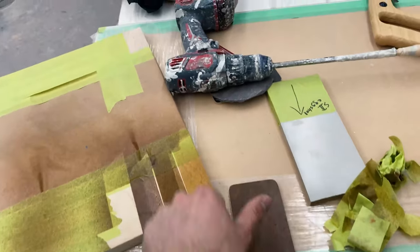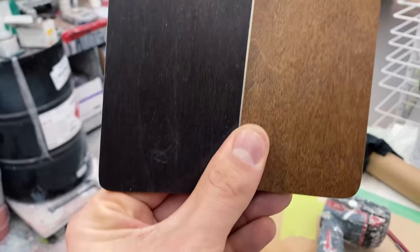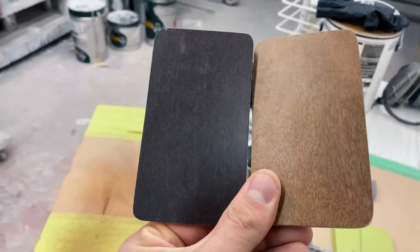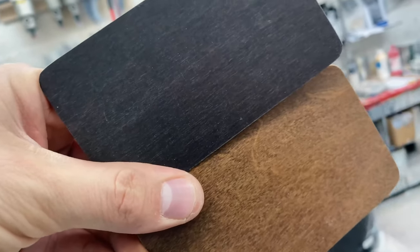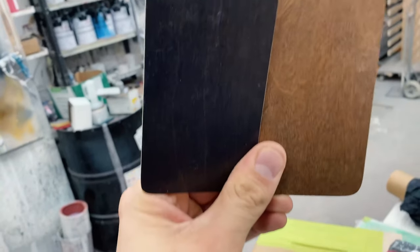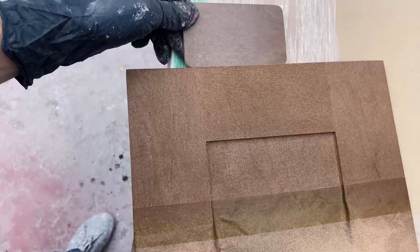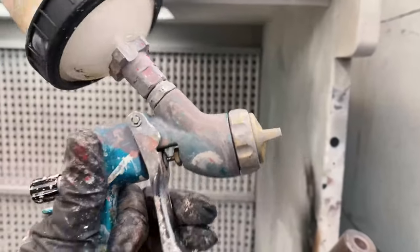Now I'm going to do the second color. You guys know how to do the light brown — this second one is a lot deeper and darker, but you have to find the base colors you're going off of. I'm assuming I'm going to be going off of the same red and black — there's not much blue, green, yellow, or anything like that. As you can see this is pretty red, so I'll do more black, more red and see what it looks like. I also put my stain on a bigger sample — it looks pretty good. This is just the stain with no clear coat so the wood looks pretty dead flat, but the tonality is pretty damn close. Now it's time for the clear coat — we have two-component acrylic polyurethane.